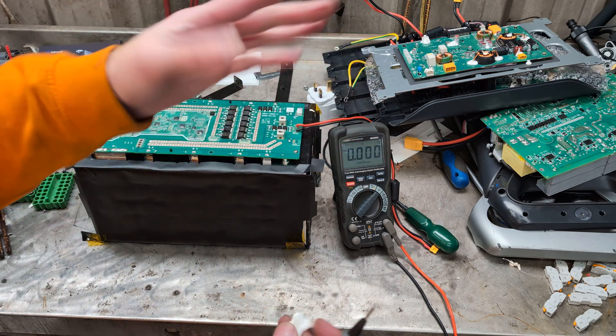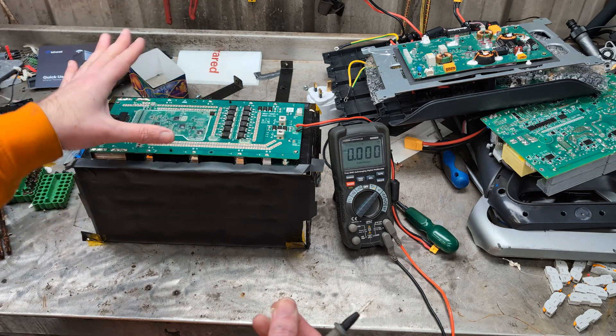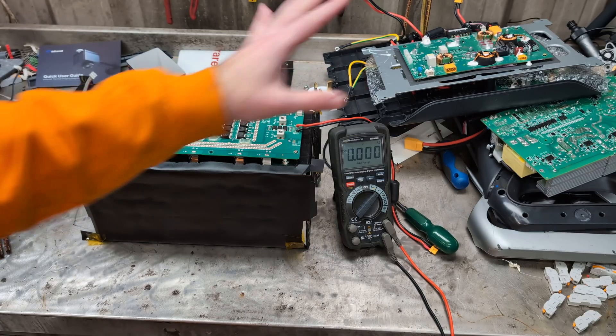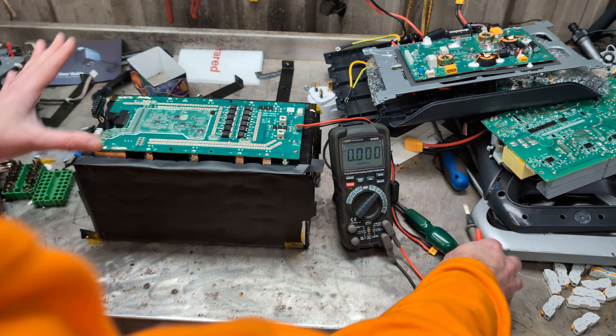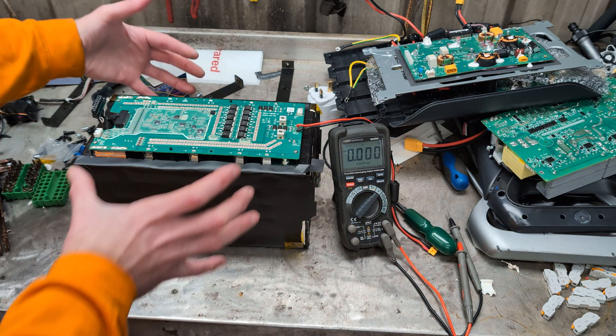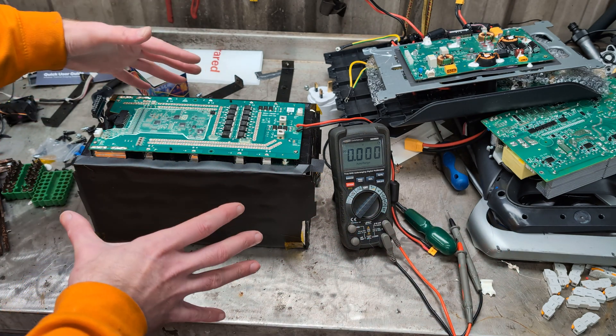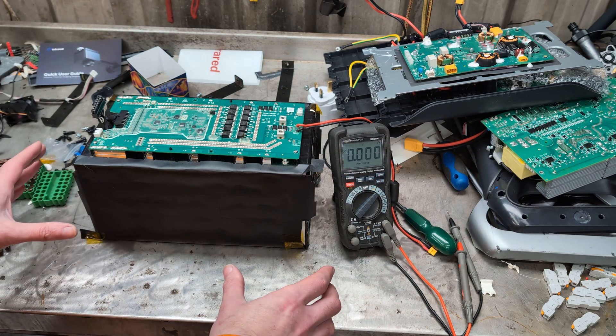I've established now from the comments and other people that it's a 48 volt battery pack. I'm not sure what the low and the high voltage is, but it's a nominal voltage of 48 volts. I've taken the bits off and this appears to be two halves of 48 cells stuck together — 96 cells in total.